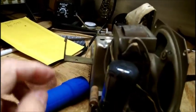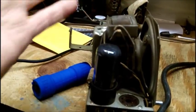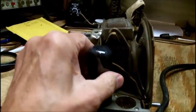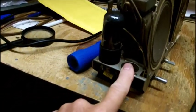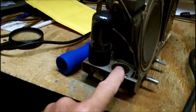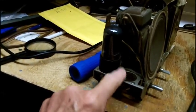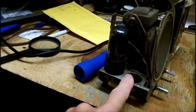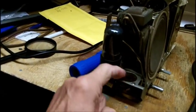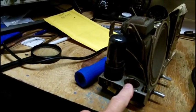What I'd have to do is change the whole speaker magnet field coil assembly as one unit — I'm not going to do that. I need to look for a 35Z5. I have a couple of feelers out there. I was told by one of the guys on the Antique Radio Forum to put a 45Z5 in here instead.